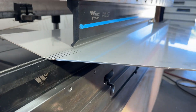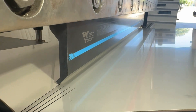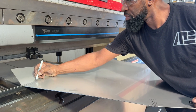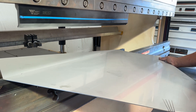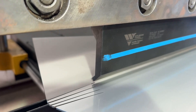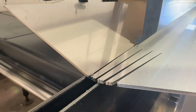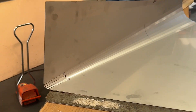One of the most challenging parts to bend on this assembly is what we call the square-to-round transition. What we're doing here is called bump forming. Normally on a press brake you hit it once and make a single bend, but here we're making a series of small bends barely offset from one another to create that big radius. Instead of moving the part in a square fashion, we're rotating it about one corner — that's why you see this series of bends, one after the next, creating the circle on one end and the square on the other.